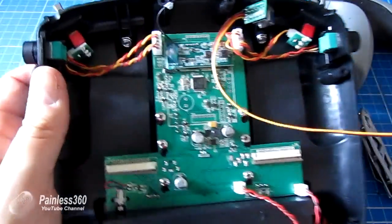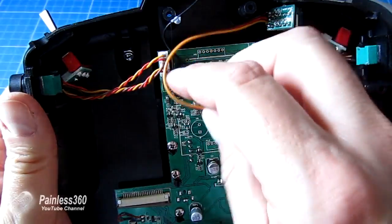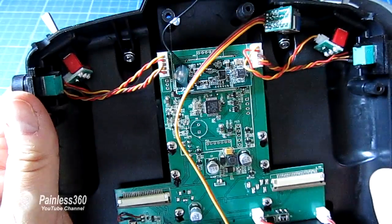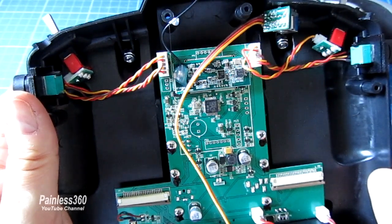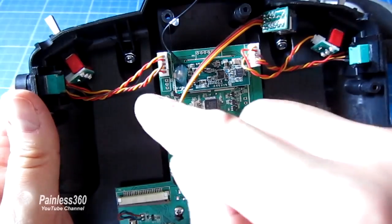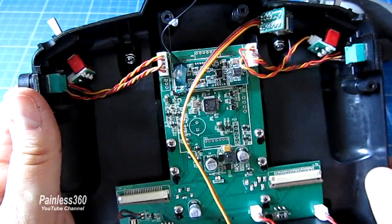Where it's going to install in the radio is into three pins. The top pin is ground, the middle is flap, and the bottom is VCC. I'm going to feed this around the back and put them on. So I'll get the wires stripped back and wire it very carefully into those three positions.